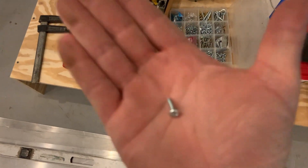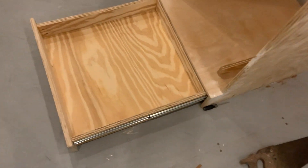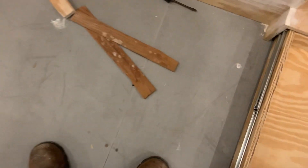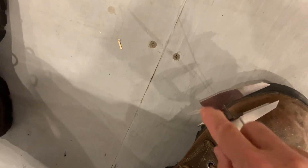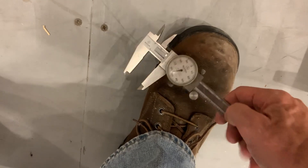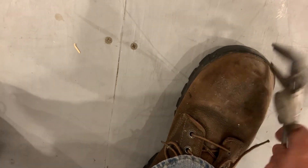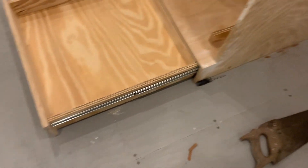Normally you'd pre-drill an eighth inch for these screws but I wanted a little tighter since I'm going into wood. I took my dial caliper and measured from the same reference points — from there to there equal to there to there — matching the depth at both ends of the inner piece in the back, and made this side match exactly. We're super super close and the drawer is absolutely perfect.